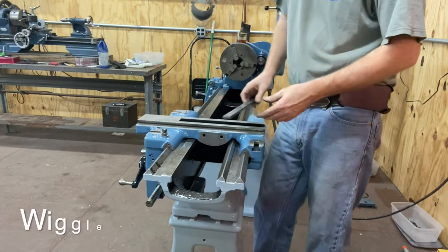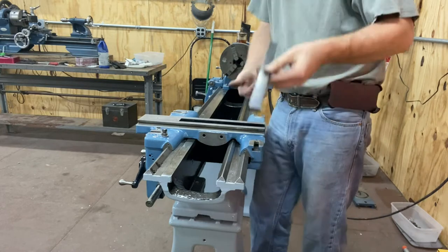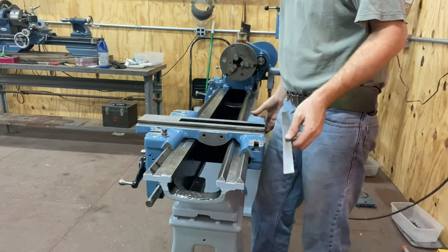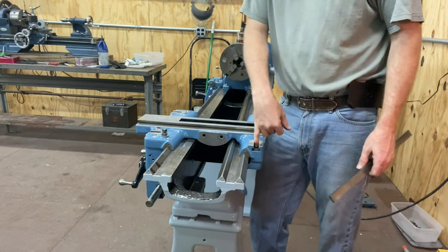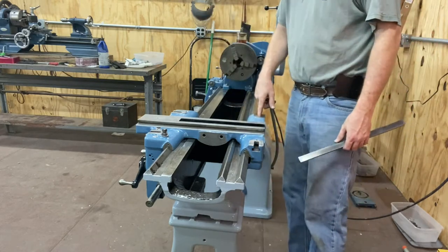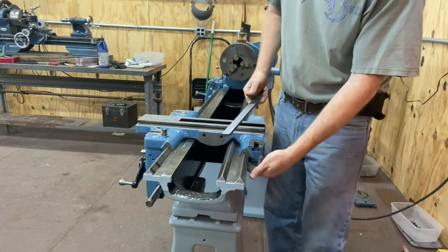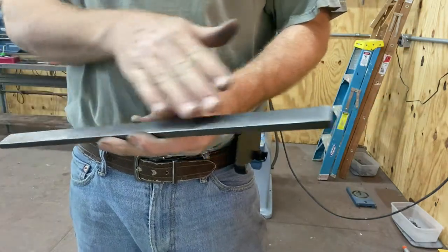There's wiggle, and that's what the gib is for — you slide this underneath and then there are bolts that push up so you can get it just tight enough that it doesn't wiggle but not so tight that it doesn't move. I'm looking here and there's a hole right down in the base and I'm thinking that may be an oil access hole to oil the top surface against the bottom. I'm going to put in some irregularity to hold some oil here.